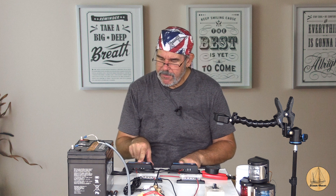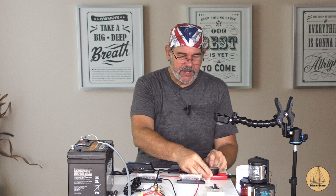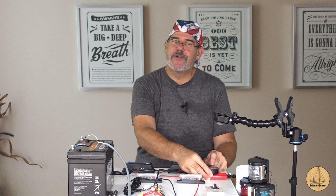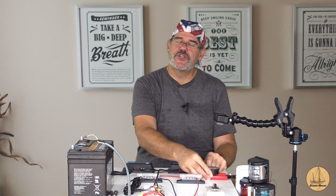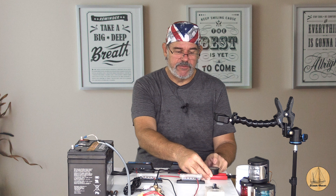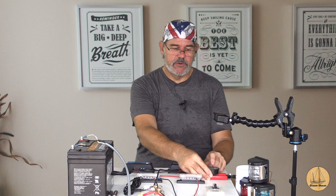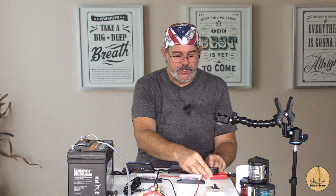Let's take a look at the unit in operation. As it's sitting here on the solar charge controllers, I have a small amount of amperage coming in — sitting at 0.54 amps, so about half an amp coming in right now. I click the volt button and can see the batteries are at 12.78 volts. Clicking the percentage shows the overall charge percentage. Clicking amps shows my total amp hours at full capacity — I'm at 35 amps. As the battery drains, this would correlate with the digital readout.